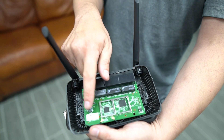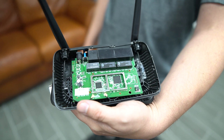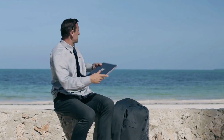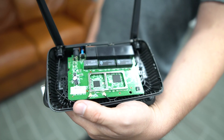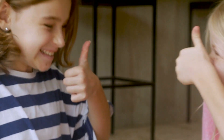On top of here, you can see that you really only have one little thing for power conditioning — this is a little capacitor right here. So if you get a power surge, if it's a little bit more power than this capacitor can handle, you'll find these things will lock up or weird things will happen. When you look at something that's always going to be on for so long, oftentimes you'll find stuff gets corrupted. When you have a power spike, you can get all sorts of bits corrupted, and you'll get weird stuff — that page not loading, random dropouts. Your only real solution is you can't reboot parts of it; you've really got to unplug the power and plug it back in. That's your only action.